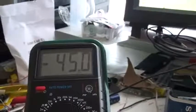Now something very interesting I will show you. I put the rotor and now I put the leads and the motor is going. Let's speed up the motor and we go to the amp draw: 45.5 amps about. And now I will take the speed here — it is 1,108 RPM.